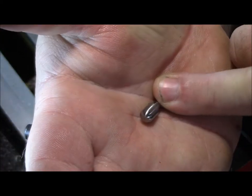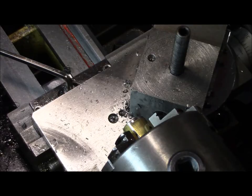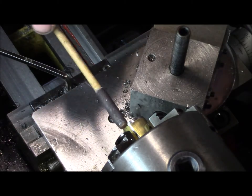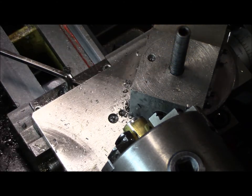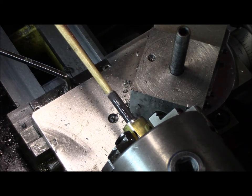There it is — I just rounded off the tip to make it look like a ball bearing, and it's going to sit inside that hole. I glued some sandpaper onto a piece of dowel and I'm just going to run it in there, let the sandpaper do its job, put a little oil on it, and keep a good polish. I want it smooth so the spring doesn't have any friction on the inside.